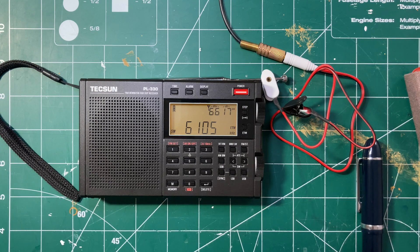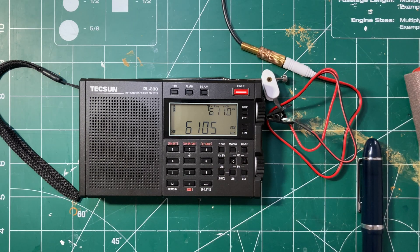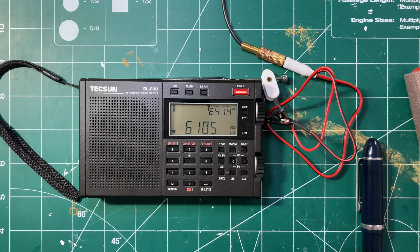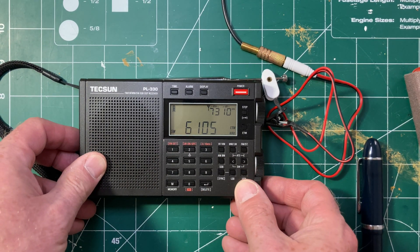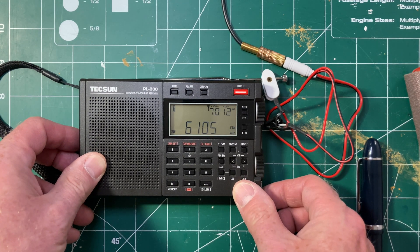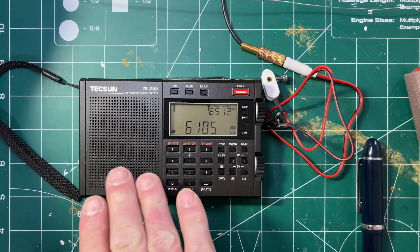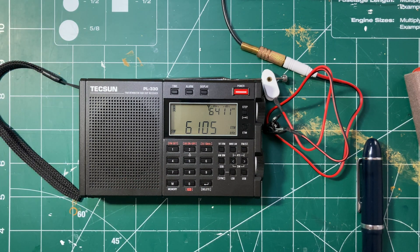My conclusion is I don't think it makes the slightest bit of difference whether you have the ground connected or not on these little portable radios, and that's probably because the radio itself is battery powered and not connected to anything. It's interesting though that sometimes the capacitive coupling of touching the radio will make a difference — it sure looks like it is here, it's at 71 dB. How about if I touch the ground wire and do that? I'm not convinced this makes a bit of difference. Anyhow, hope that was useful. I'll just say: inconclusive. Thanks for watching.